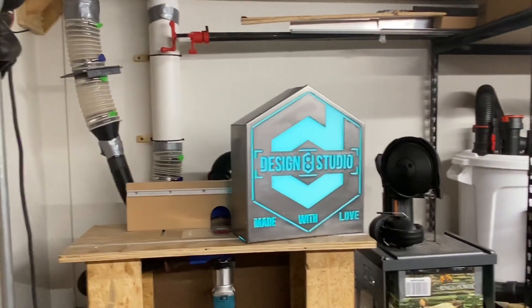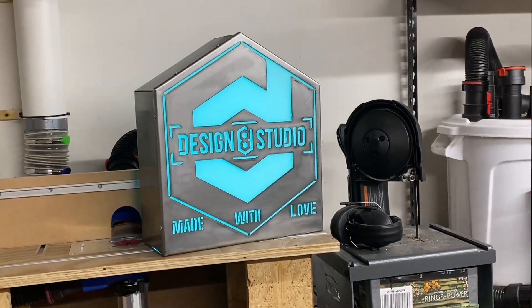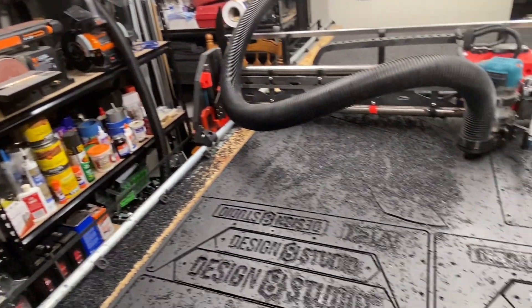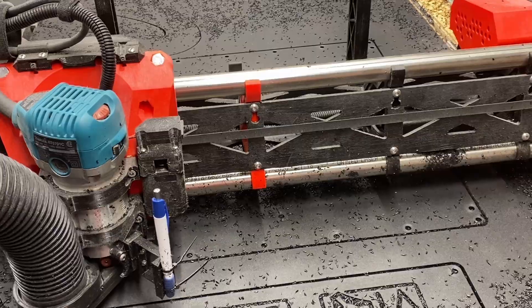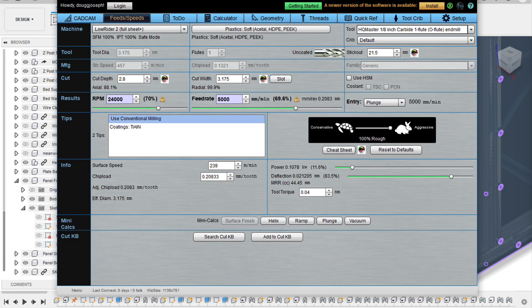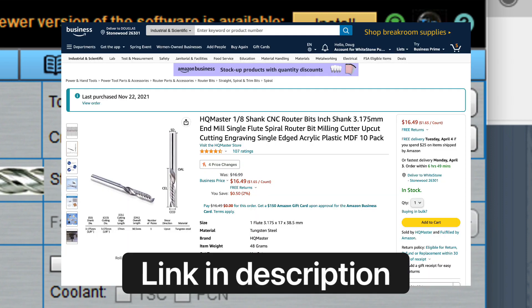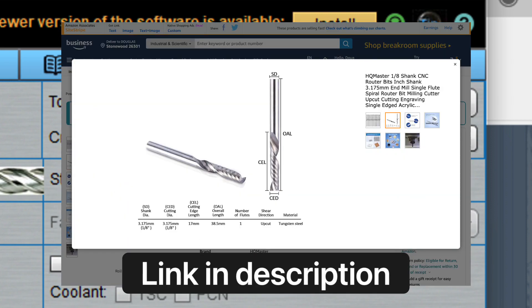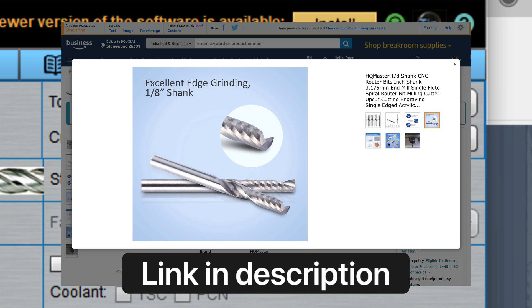I had to back out and fix the feeds and speeds. One of the great things I've done since then is get a tool that helps me know what feeds and speeds to use — I'm using the G-Wizard Machinist Calculator, which stands for G-Code Wizard. You go to your tool crib and create a tool. In the upper right-hand corner, the tool is a 1/8-inch carbide 1-flute end mill. This 1-flute end mill is really good for cutting plastic — it's often called an O-flute because it's so open it looks like an O winding up the bit.